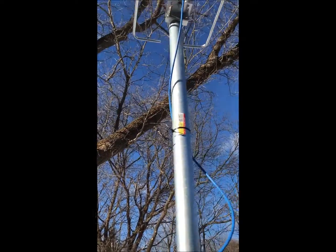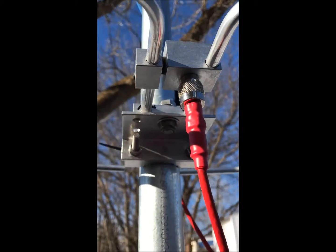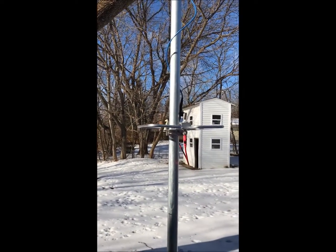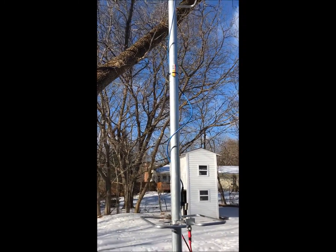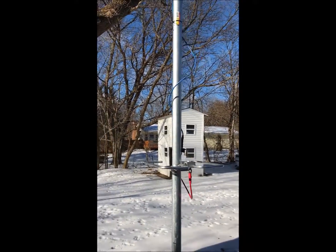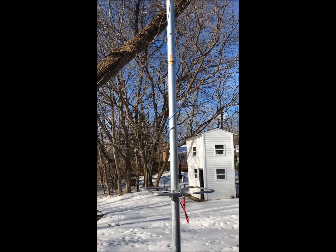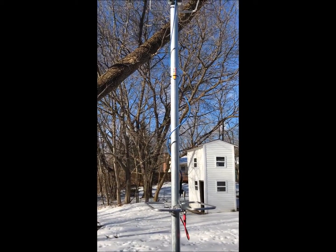Some of the other things I tried: lining them up where the top one favors the left side and the bottom favors the right side — I switched it over. I also tried different lengths of feed cable, like three-quarter wavelength on both top and bottom. Your adjustments change, separation is different, the SWR is all over the place, and the resonant frequency would change as well. So I decided to use the lengths from the specs I found online for the phasing harness they sell for 150 bucks and went from there.